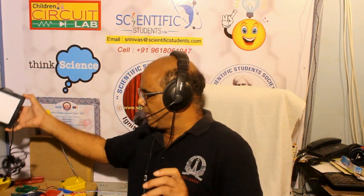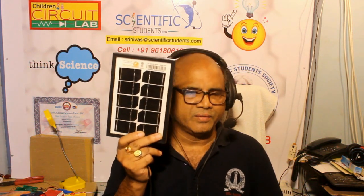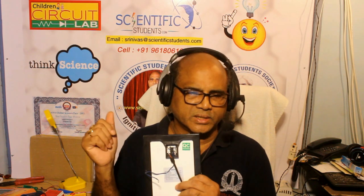If you charge the battery at 0.5 ampere, it will take 4 hours to charge fully. The panel we provide has a maximum charge current of 0.5 ampere. With this panel connected to our lamp, it will charge the battery in 5 to 6 hours. The panel operating voltage is 5 volts and open circuit voltage is 6 volts - when you connect a device the voltage drops from 6 to 5.